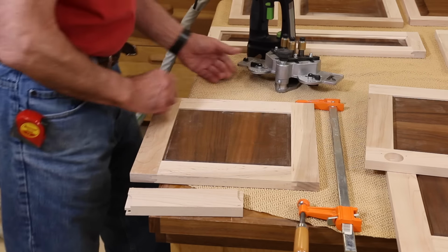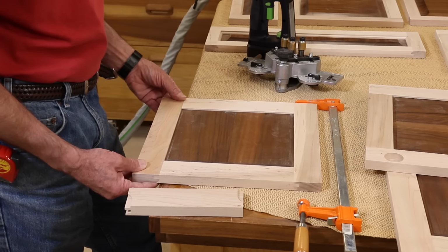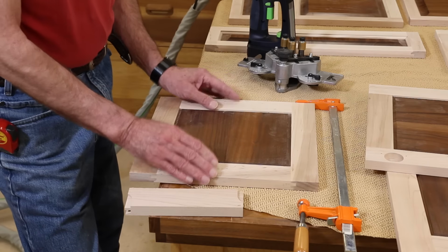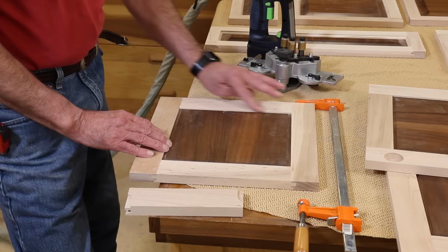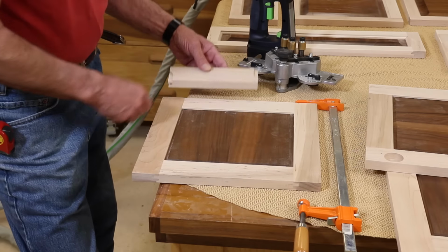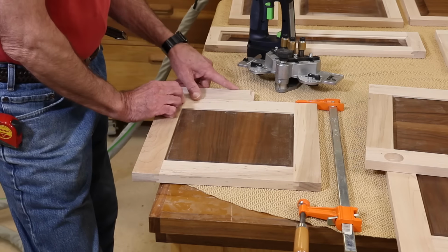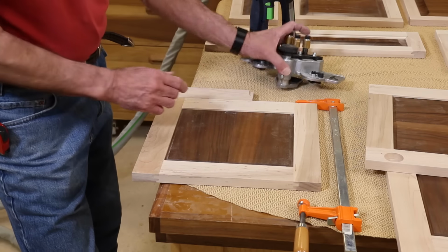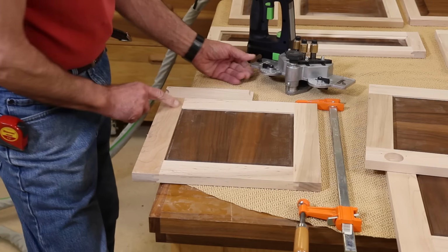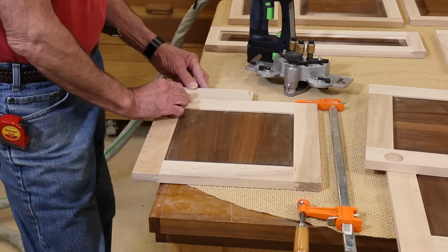Now I want the center of the hinges 2 inches from the top and 2 inches from the bottom on these small doors. As it turns out, my rails and stiles are 2 inches wide, so I'm just gonna use the rail as my mark. But I've got to put a scrap of wood in here and line it up because the guide is off the end. With only 2 inches down, the guide is off the end. So I'm just basically extending this piece of wood a little bit,